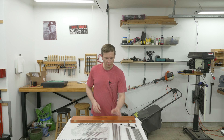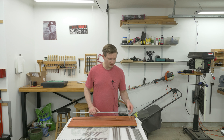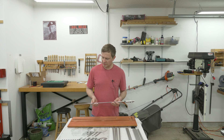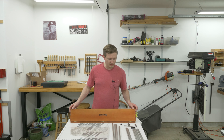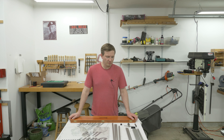What I need to do is go over to the mill and machine all these to length, because they're just cleaned up on one end. Since these are larger than most standard calipers can measure, I bought these as a Christmas present to myself — these are 24 inch Starrett vernier calipers. They're old but in excellent condition. I've had to do a little practicing because it's actually quite a bit harder to use than a standard dial or digital indicator. Let me switch cameras over to the mill.